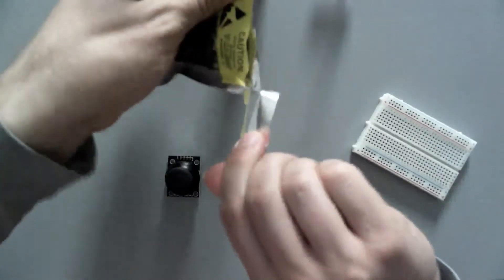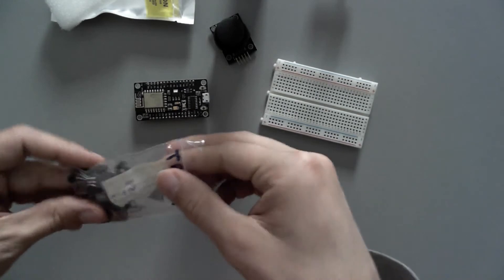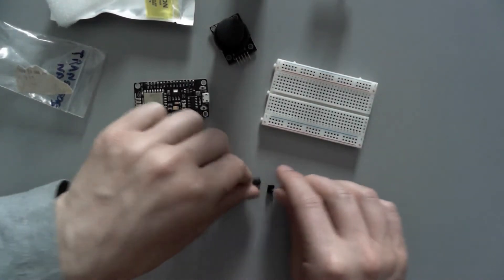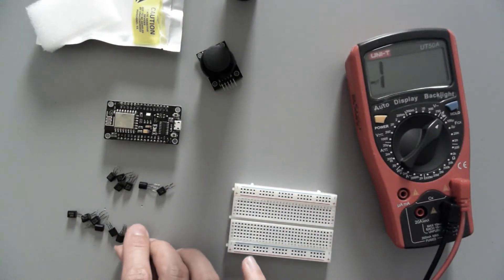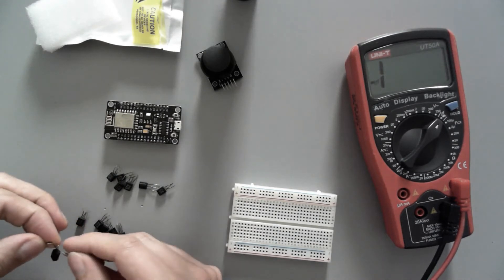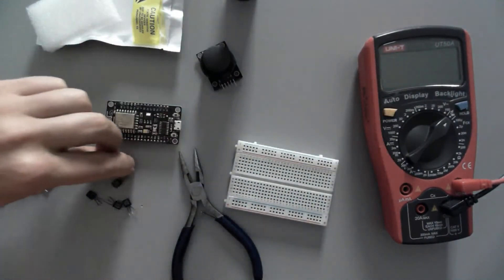I have a bunch of kit here. I've got a nice fresh NodeMCU and a bag of pretty generic, some of them pretty crusty, NPN transistors. Some of these are ancient — older than my children, maybe from when I was a child starting to play with electronics. Let's find at least two with the same markings. I'll go with my multimeter in diode test mode to see if any of them are alive. Their ends are quite corroded. I only need two. That one's dead — the only way to be really certain is to try building something with them.